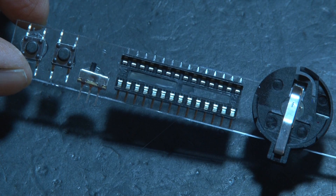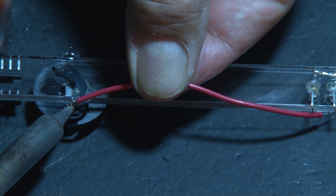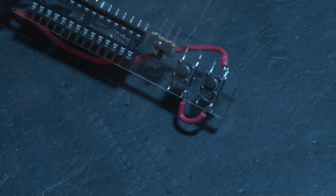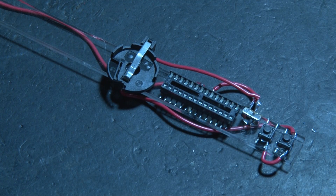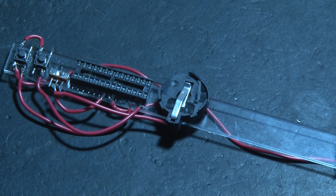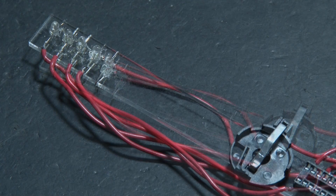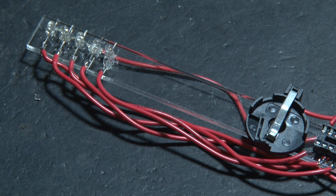When we're done, all of our components are ready to go. Now it's time to get to the wiring. We'll run a wire from the negative side of our battery holder to the negative strip of our LEDs, then another wire will go to our IC chip holder. I'm not going to go through each wire and where it goes, because I'll provide all that information at a link in the description. There are a few wires that'll go from the switches to the IC holder, so we'll solder those in place. Then it's time for the wires that go to the LEDs — we have five LEDs total, so a wire will go from each positive lead of the LED to different pins on the IC holder.